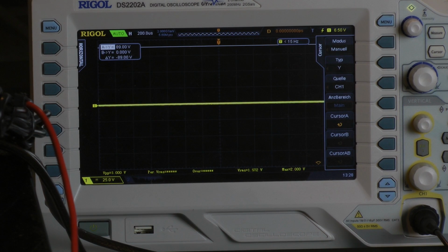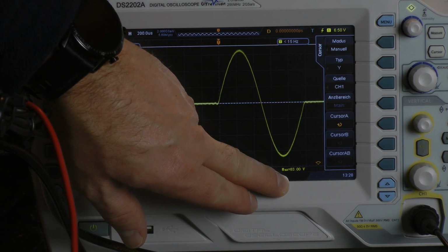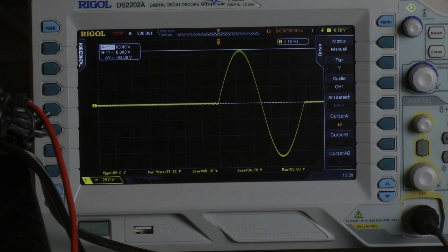And now let's check out the absolute peak power for 1 millisecond. That's a clean cycle. Scope says maximum voltage 83 volts. I go down. It even says 83.5. Let's use 83 volts. The amplifier puts out 440 watts mono 8 ohms and 220 watts per channel into a 4 ohm load of dynamic power with just one cycle. That means for just 1 millisecond.